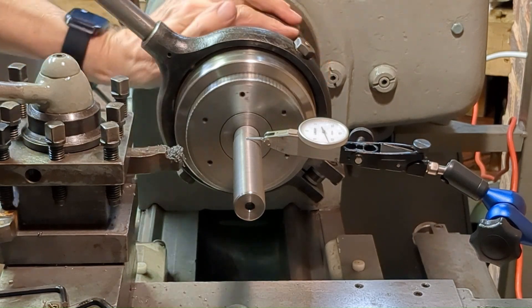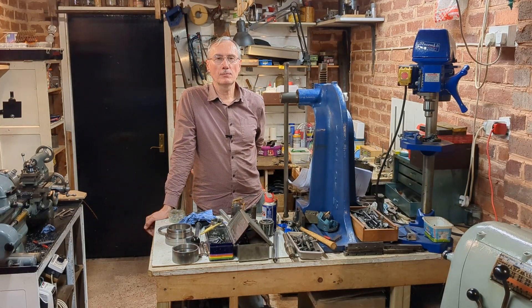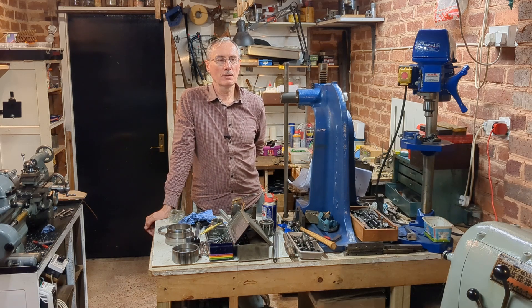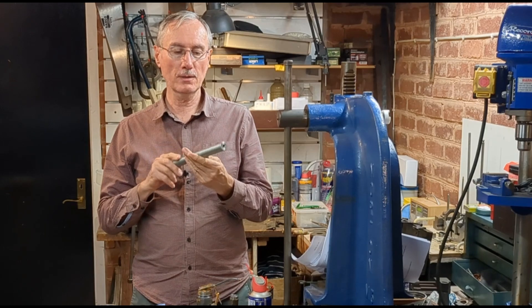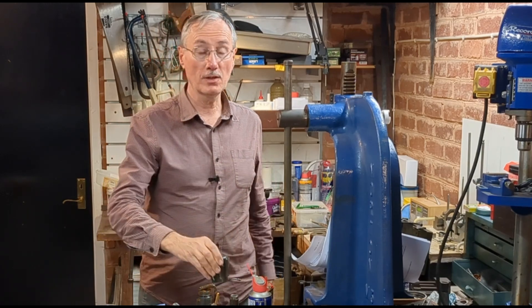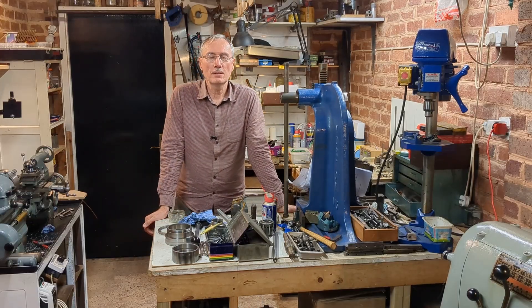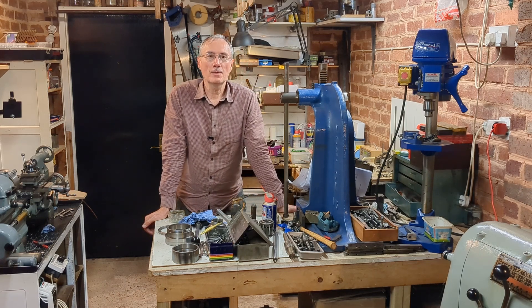I think what I really need is a ground test bar and to repeat this test, so I might do that at a future date. I really didn't feel happy with the outcome of this video — I think there's more work to be done on this collet chuck. I wasn't expecting to take the chuck apart; I thought it would just be a question of fitting it and the linkages. But there are a few issues. The test bar wasn't adequate and needs more careful thought. I also need to isolate whether the error is due to the collets themselves or the collet chuck — and I suspect it's the collet chuck. So that's going to lead me into video number 4, where we'll take the chuck apart, inspect it, see what we can do to improve run-out, then test it again. Thank you for joining me and I hope you'll join me next time.